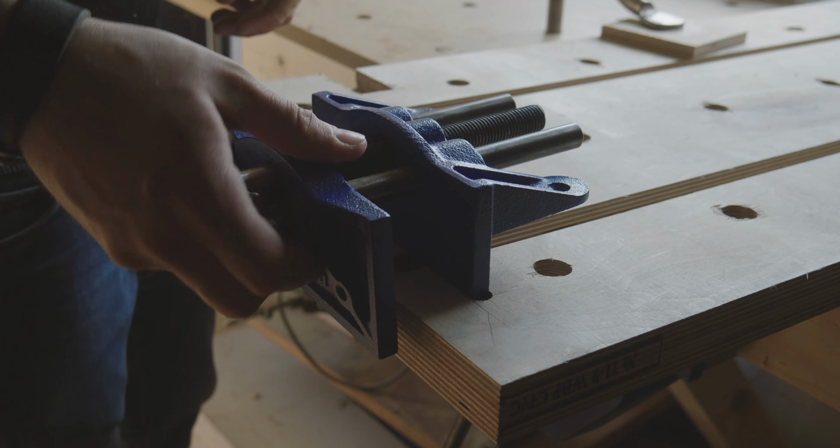I imagine the workbench as a modular system. Several modules together form a workbench. They are connected through biscuit joints and toggle lever clamps. The toggle lever clamps should be located in a recess under the workbench, so that they don't get caught on the beams. The panels should be securely connected to the beams so that they do not slip back and forth when working on them.